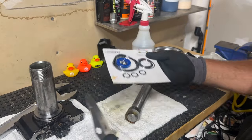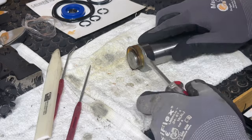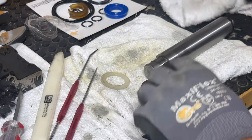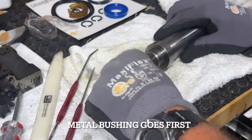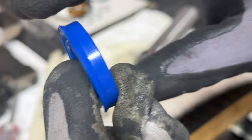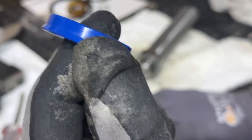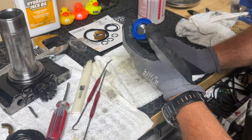This rebuild kit contains more parts than we're going to use. I'll very carefully open it so my knife doesn't hit any o-rings. First, I'll carefully remove the old wiper seal — it's real brittle, that's why this jack really isn't working. We'll reuse the plastic washer. I'll put a touch of hydraulic jack oil on everything during reassembly. With this seal you can see it has a lip on it — when oil comes in, it pressurizes this seal, pushing this little rim out to the edge of the tube, making a seal and pushing the ram up.